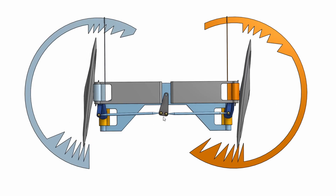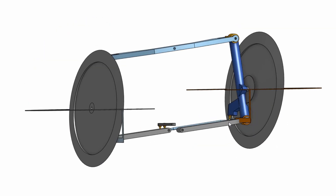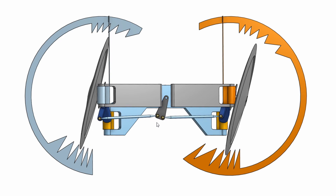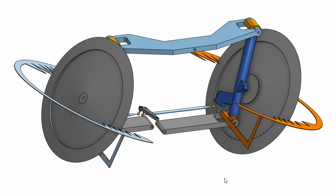The tilting and steering actions are shown. Checking the Ackerman geometry in bottom view, the wheel on the left is pointed at the fourth serration and the wheel on the right is also pointed at the fourth serration — the Ackerman geometry upright is spot on. Applying 30 degrees of tilt, the Ackerman steering is perfectly preserved. With this design, the tie rods exactly equal in length to the lower wishbones, the tilting angle doesn't affect the angle of the steered wheels and the Ackerman geometry is preserved throughout the entire tilting range.